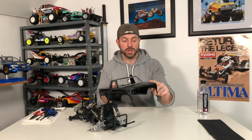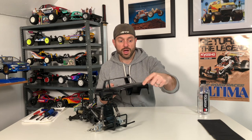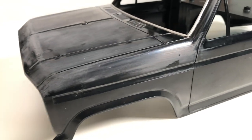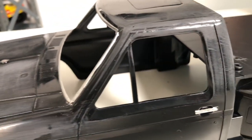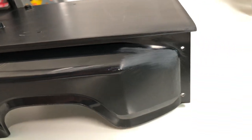And for the most part, just with the 400 grit sandpaper, this is super smooth. I took out all the scratches and all the scuffs for the most part, so I'm really pleased with that. Now I'm going to go on to 600 and work my way up to 800, and then finish it off at 1,000, and then prime it.